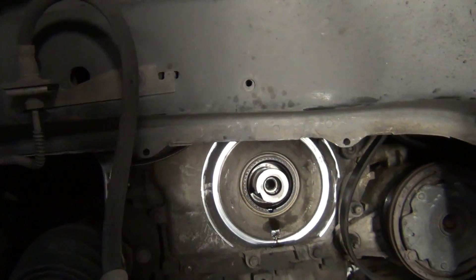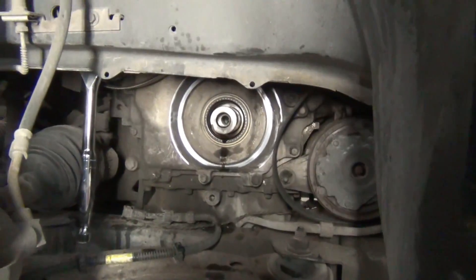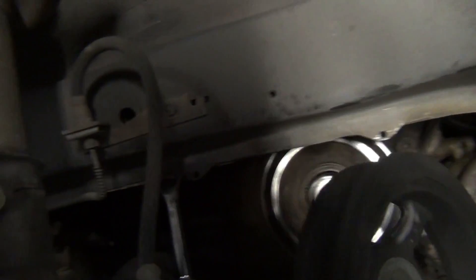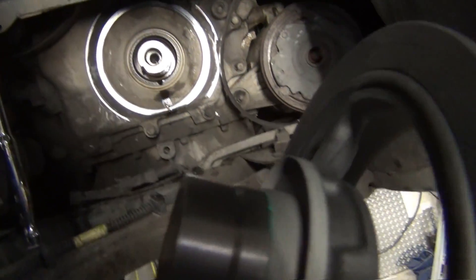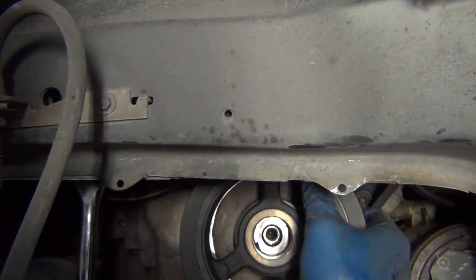Should we replace the seal? Normally I wouldn't even think about it, I'd just do it. This one's doing fine and I am way behind, so we're not going to. But the seal is going to ride on this ring, so it has to have some grease on it - that is non-negotiable. Or else the new one will leak and it wasn't the seal, it was putting this stuff together dry. I'm looking for synthetic green grease, so I went with crimson. I prefer marine-grade grease but I just want something synthetic and stringy.